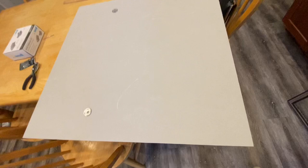Normally on any substrate with a foam core like this one I would wrap the edges with alkali-resistant fiberglass tape and then put a layer of thinset on to protect the edges. But in this particular case I have found the perfect frame that I've had in my garage for a while. That is why I cut the piece 30 by 30 — the frame fits perfectly in there. I'm going to paint the frame first, and on the back when it comes time to mount it I'm going to add a bracket in each of the corners with screws to keep it in place.